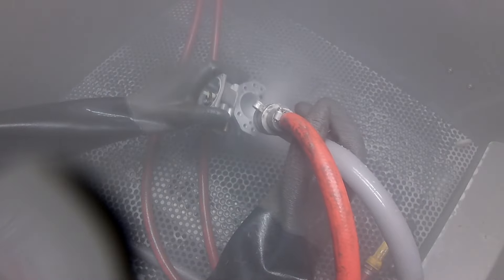Starting off with glass bead — 99% of the time, we will recommend our customers to use glass bead if they are wanting that bright, polished look. It's great if you are wanting to achieve that OEM finish. It is also one of the less aggressive medias that is out there.